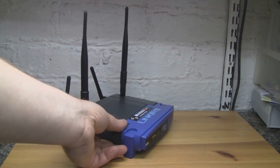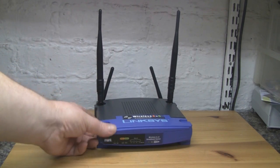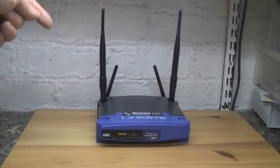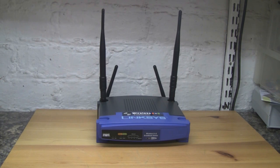I hope you enjoyed that video and how I turned this — what was really a flop at the time of its release, costing around $180 — into a proper performing router. With these modifications to the heat problem and splitting the antennas so we've now got direct 5GHz and direct 2.4GHz not mixing at all, it should perform a lot better. With the heat sorted, it shouldn't reboot all the time either. It's a shame it's version 2 so I can't put custom firmware on it, but I'll keep an eye out for a version 1 at a good price. If you enjoyed this, please give it a thumbs up and hopefully I'll see you on the next one.